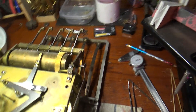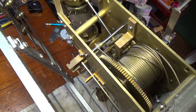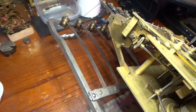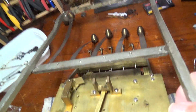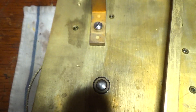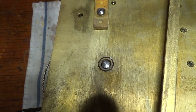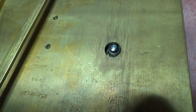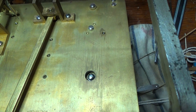Having not worked on any like this before, I'm going to have to study this one, take lots of pictures before I take it apart, and understand how it operates. Then we are going to make the repairs necessary to get it running. I've already determined what the big problem is. Here's one of the arbors for the first wheel, and you can see the bushing around it. On the other side, the bushing for this particular wheel has simply fallen out and is gone, so we'll have to make and replace it.